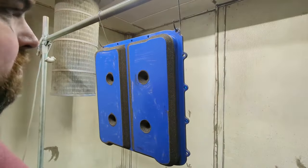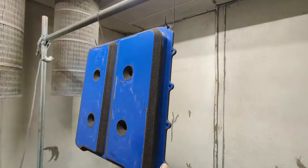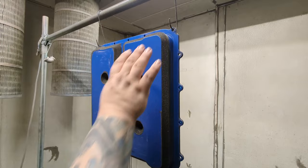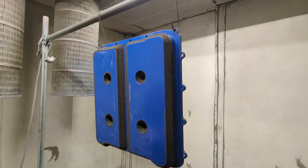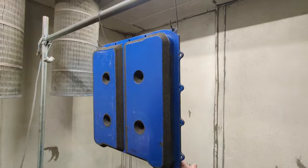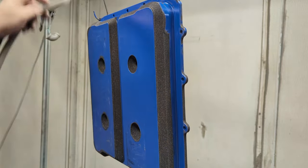And one thing to remember when you're doing this with the wiping process, you want to be trying to wipe powder down away from whatever you're working on. So you always start at the top and push it down. Obviously, let gravity do some of the work for you. Plus, you don't want to be wiping lower parts and then brushing away stuff at the top as you work, which just knocks it down to the parts you have already done. So you're going to go through, cut all these lines, and a finger and just a wet towel works great.